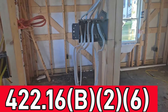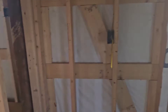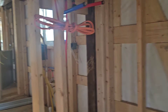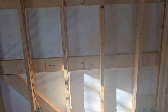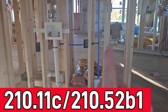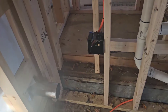So we're going to have to go through the whole house and check all of his box fill, but thankfully he's taken my program and he'll be able to go through and do that. Down here in the laundry room he's decked it out, and modern-day houses are usually over-circuited. We have our water heater here, and then he's pulled a home run just for this room outside of the required laundry circuit. I'll put the code on the screen for the requirement for the two kitchen small appliance circuits and the one laundry circuit. Then on top of that he has a dedicated laundry circuit, and it looks like he has his 10-3 run over here for his dryer.